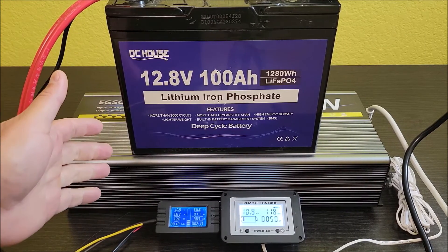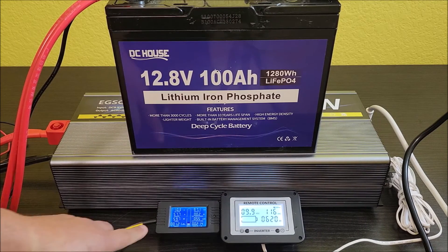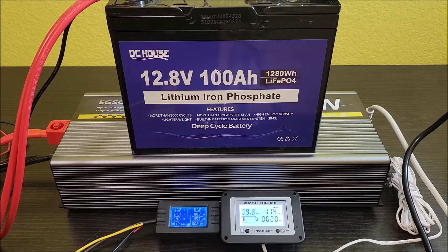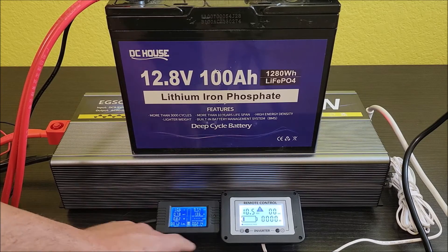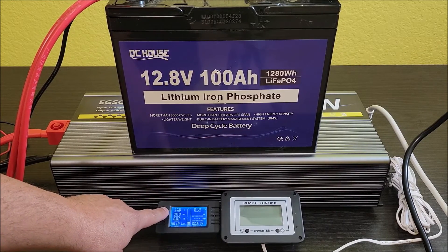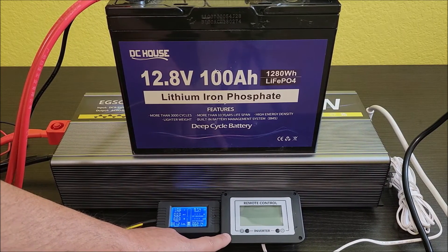We have a lot of RV work coming with solar and batteries. Just heard the compressor kick on — it's already nice and cold in this room. Exactly what I expected: the extra load from the compressor kicking on pulled the voltage down. That was it. The voltage dropped under 10.5 volts so the inverter itself dropped out. The BMS is still running since it didn't drop below 10 volts — I believe the BMS cuts out around 10 volts, but the inverter dropped out first at under 10.5 volts.